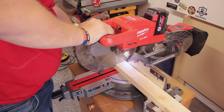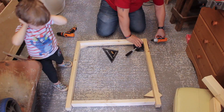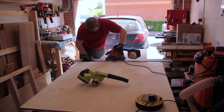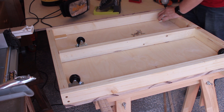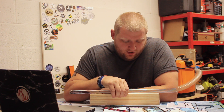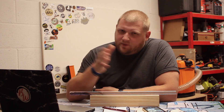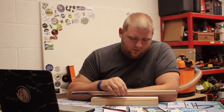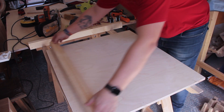I managed to pick up some small lightweight two-by-fours and started building just a basic square frame. The base is roughly 800mm square, which will fit snugly in there. Most of this is made out of 18mm birch ply. I think I used too many screws attaching it to the base. The way I built it was slightly wrong and I had to use 12mm ply shims underneath the wheels. Having the wood set up that way with the wheels on the bottom, you're looking at almost four inches of height, which loses a lot of storage space in that small area.